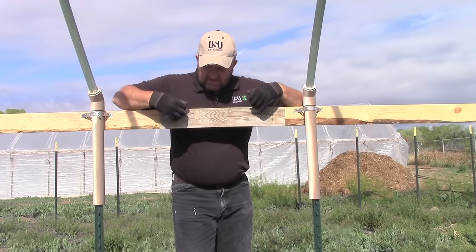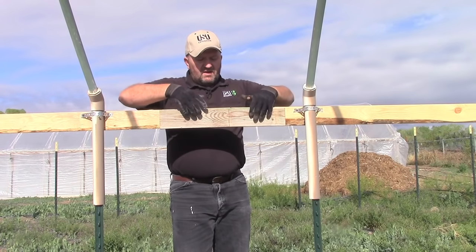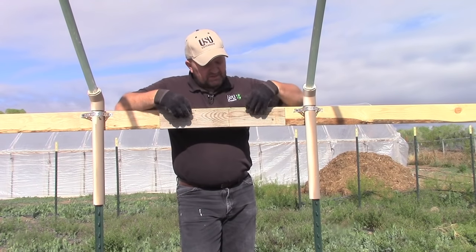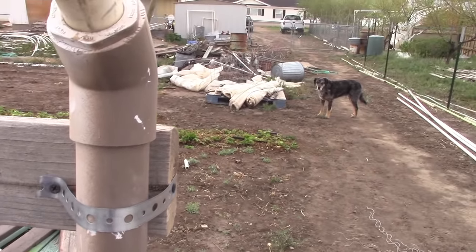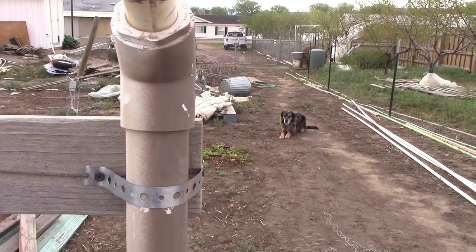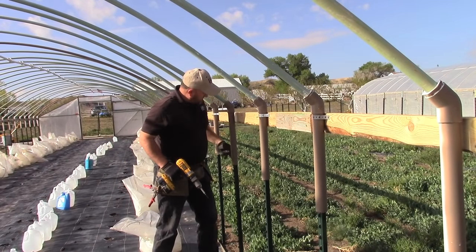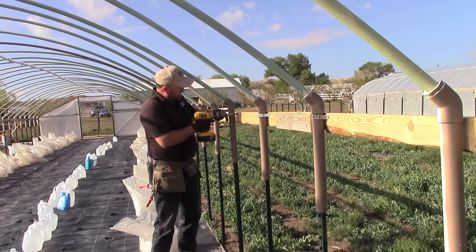I've shown how you can use nail plates along here. You can also use a 1x4 if you have it long enough and it fits in between there — 1x4 will work pretty good. I ran out of nail plates, bought all of them out of the hardware store, so I cut some 1x4 sections to splice those together. The end T-post I'll fasten in this manner — it goes around to the end of your hip purlin and around your T-post so that I've got it fastened up pretty good there to keep it in place.